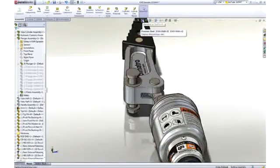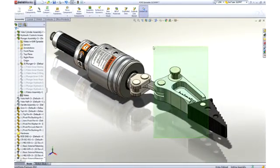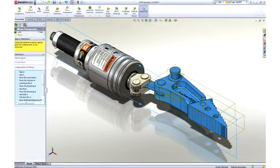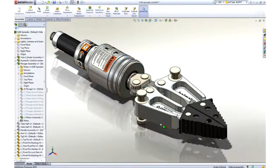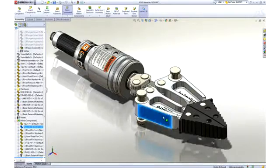Half of the spreader is complete, and we can save assembly time by mirroring the parts about the central plane to the opposite side. SolidWorks allows us to verify and change position of each part, and even to create opposite-hand versions of individual parts. In just 2 minutes, there were 19 parts added to this assembly, and our assembly task is complete.